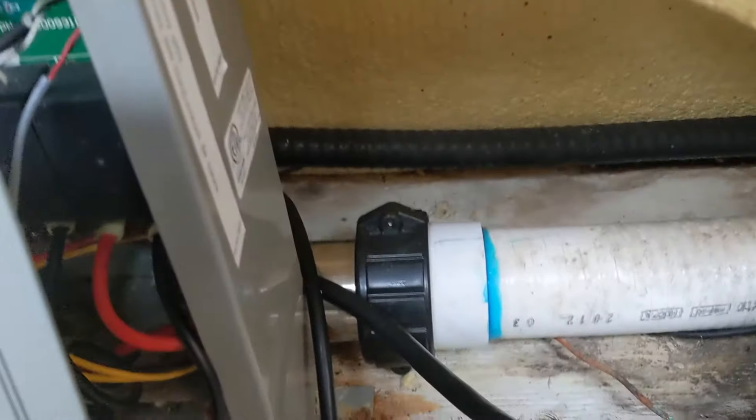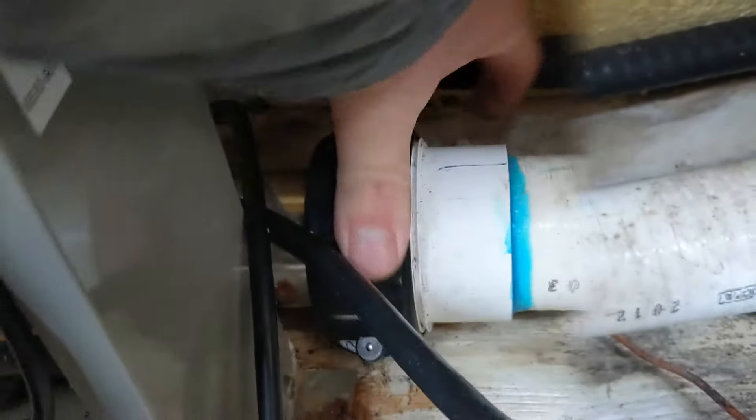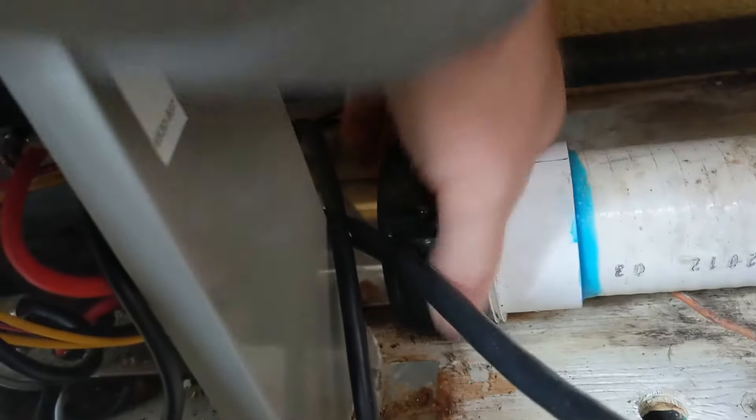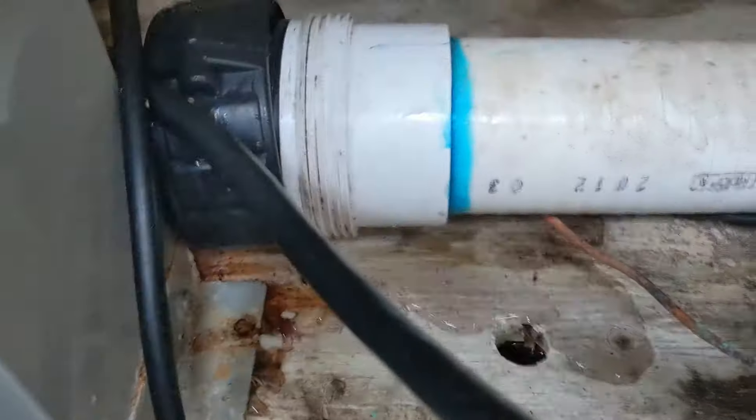I just loosened that a little bit with a tool. This is what you disconnect — both sides. I wouldn't disconnect it all the way because the pipes will shrink a bit and it's harder to get back on. We undo it enough to get a little bit of water out. And yes — antifreeze came through, you can see it's all pink, so it did work.